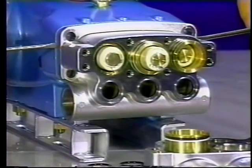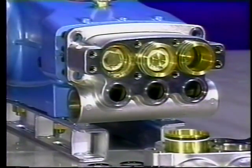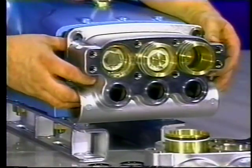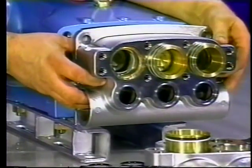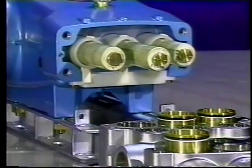Two screwdrivers inserted on opposite sides between the manifold and the crankcase may be needed to assist in separation. Support the inlet manifold from the underside and gradually work from the pump. Place the crankcase side of the inlet manifold down.